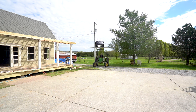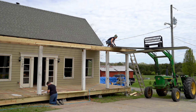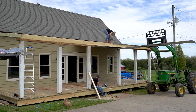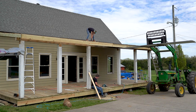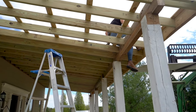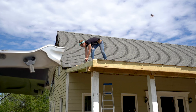Next: the roofing panels. Greg went with standard metal roofing panels, and since he has a tractor, he placed them on the forks to lift them up for me to grab and place into position. After I laid down a sheet, he'd inch the tractor forward to line up with the next needed position. After getting a sheet laid down with one corrugation overlapping the previous panel, I'd secure it with screws going into each purlin. When you buy roofing material it should come with color-matched screws that have a rubber washer under the head, so when you seat the screw it seals around the hole and won't leak.